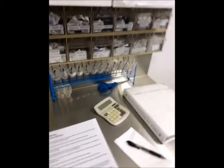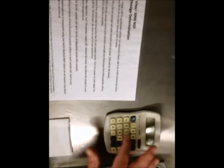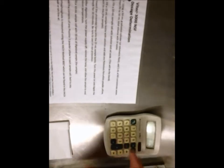Now we've got a little math to do. 2.54 is the result of the test. According to the directions, you take the result — 2.54 — and multiply that by 6.25. The 6.25 is the multiplier given by the chemical company for this specific chemical. So 2.54 × 6.25 = 15.87. That means there is 15.87 ppm of chemical in the RO concentrate — a good validation that there is anti-scalant present.